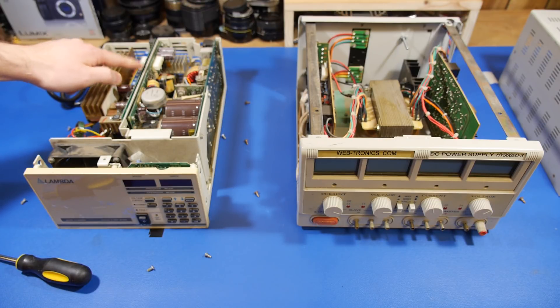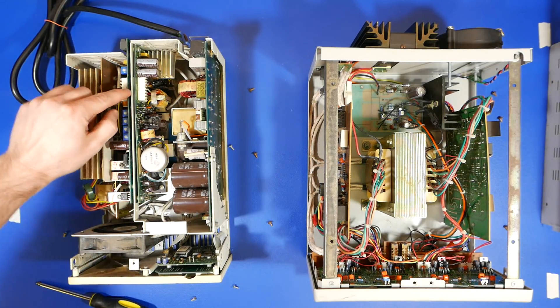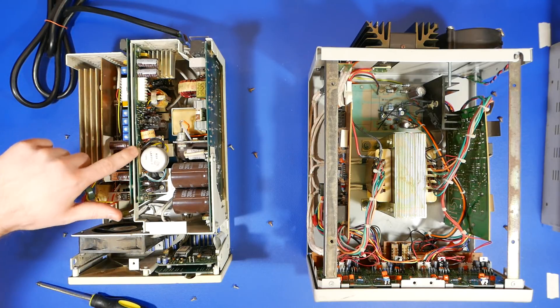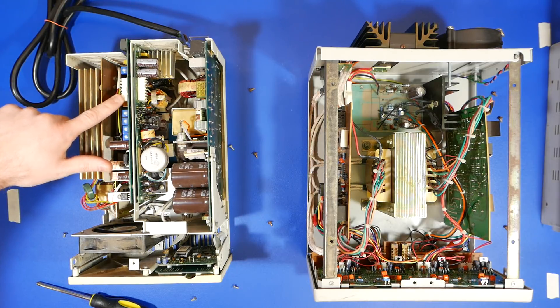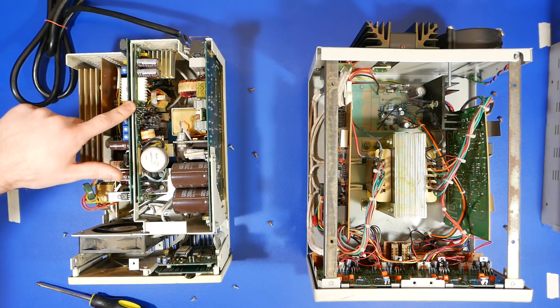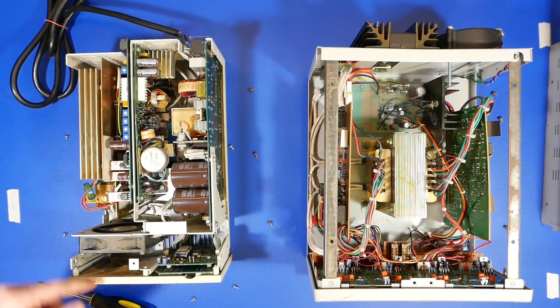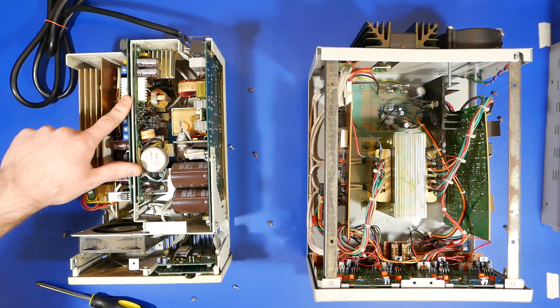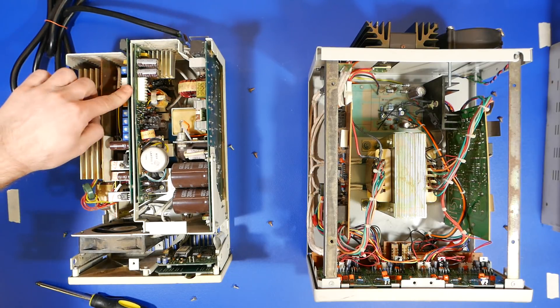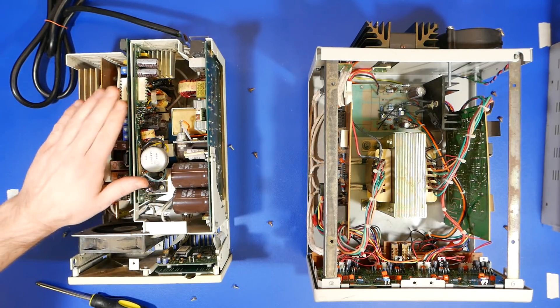Going toward the Lambda design, something interesting is the way they connected these two boards. They have a PCB sandwich along this piece of metal, insulated by plastic layers, and they chose to have a through-board connection — a plastic insert that sits in the sheet metal hole and allows a through-hole connection between the boards. It's something I don't see very often, and it's actually not a bad idea. If you used a cable and a little notch, somebody dropping it could penetrate the cable and destroy the power supply — so it's not bad thinking.